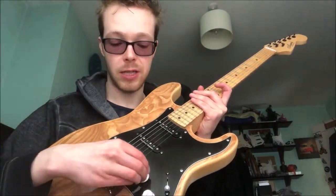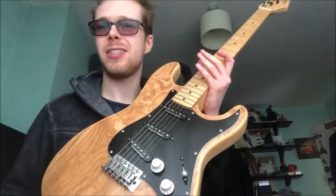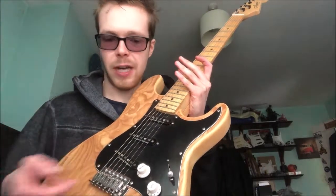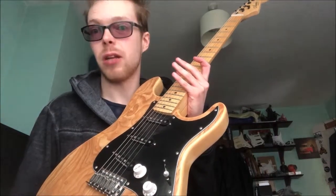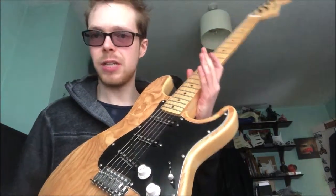So I changed that to 500k, and it helped, but it was still quite held back, still subdued, kind of muffled. If I have a 500k and turn this down halfway, it's like a 250k on full whack, basically, in terms of brightness. So still wasn't happy with it.